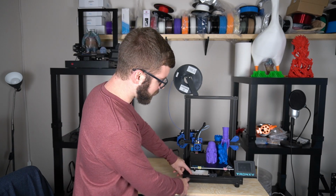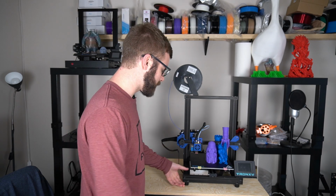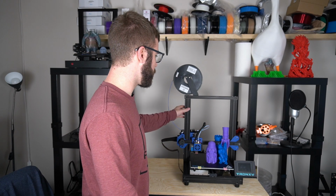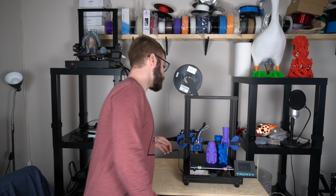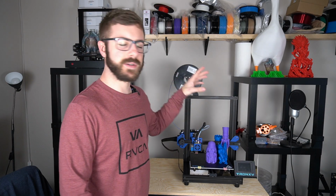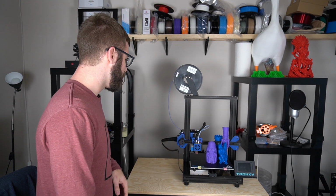The bottom of this is actually made of 40/40 extrusions, which is insane. So these are 40/40s, these are 20/40s, and then you've got obviously 20/20s. It is not supported on both sides, which is unfortunate, but there are eccentric nuts at least, so I didn't notice any issues with slop or sag of the carriage.